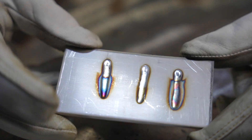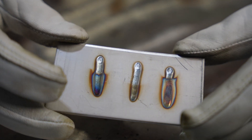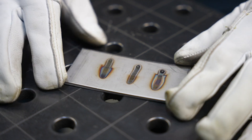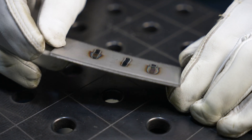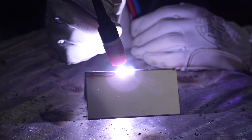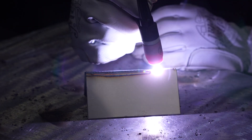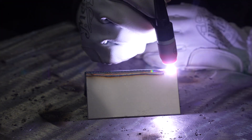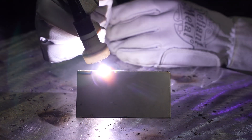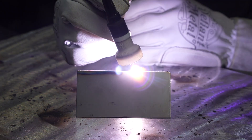The number 8 cup result on stainless is somewhere in between — the number 12 is kind of ideal for stainless like this, and the number 5 is a little small. By the way, notice how much this stainless warped and distorted just from running those three beads — it's almost like a Pringle, which is one of the joys of working with stainless steel. Now let's look at this outside corner joint on some thin stainless running autogenous (without filler). I'm using a double pulse feature — high and low frequency pulse together to pace my progression — then I'll follow with a larger number 15 cup to see the difference.